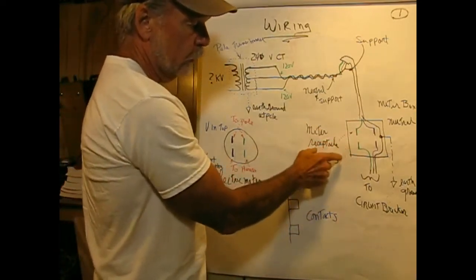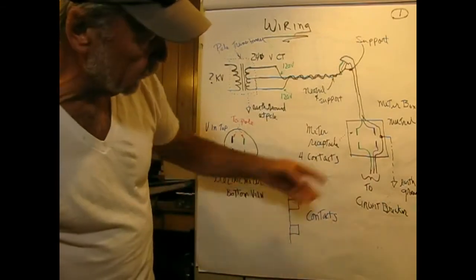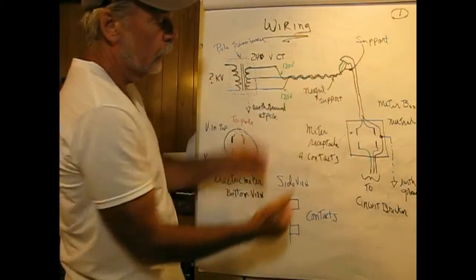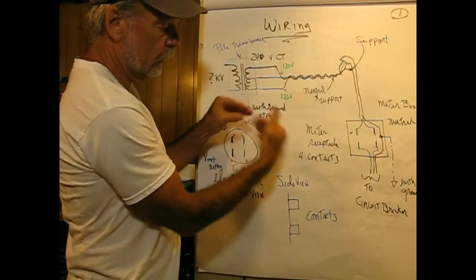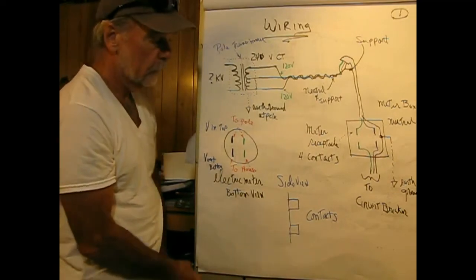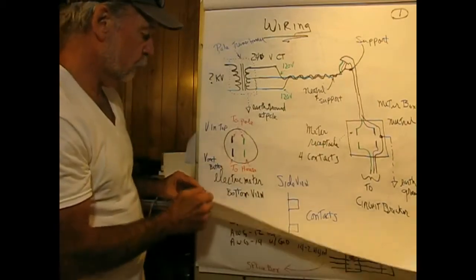Out here in the community, we had an electrician do work, and he put in a used meter receptacle. What's supposed to happen is that the receptacle has two pieces of metal like this, and then the blade from the meter goes in, and it's supposed to spread them apart. You have to push it in. He used a used box, and one of these was sprung, meaning it was not squeezing the electrical contact, and gave us an intermittent. We ended up calling another electrician in who did the job right. So never call him again. I was involved in this, and there's no way I'm messing with this stuff. It's just too dangerous.